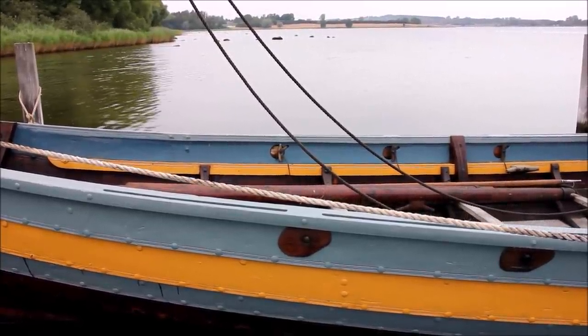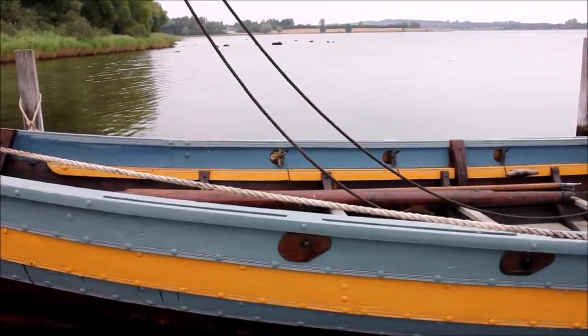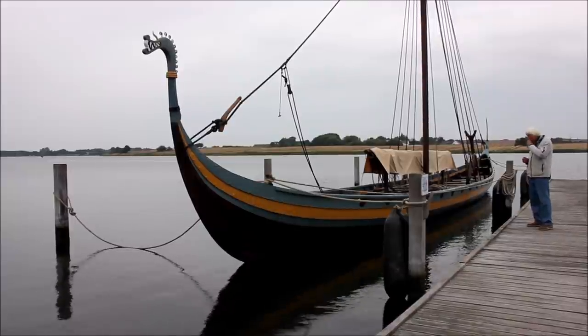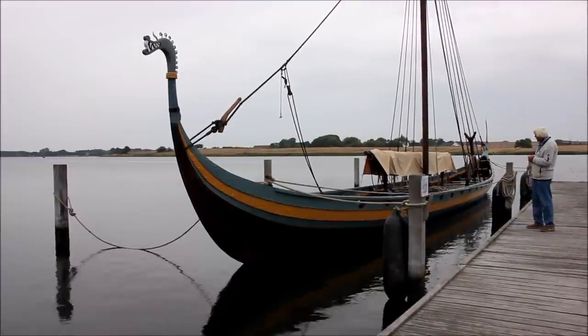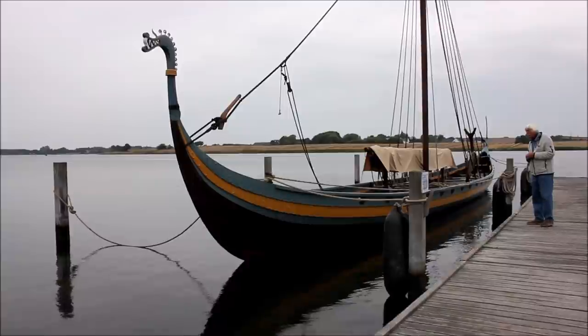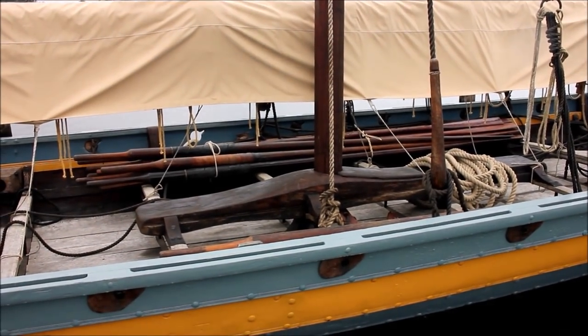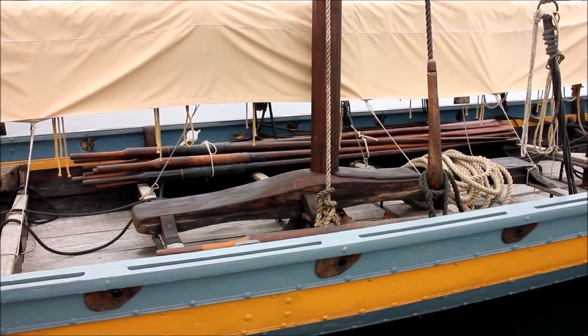These vessels always made a certain amount of water at sea one way and another. I'm sure quite a lot slopped over and they were bailing them all the time, so a little bit of extra through there wouldn't really have mattered. The mast step is fascinating. It steps over four thwarts, which are themselves on sort of ring frames to the floors underneath the sole that you'd walk around on, into the structure of the ship.